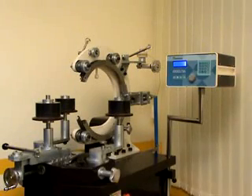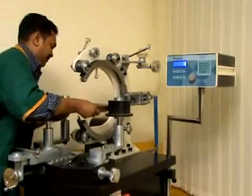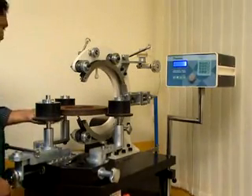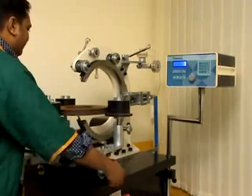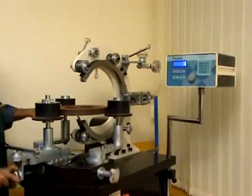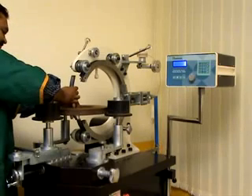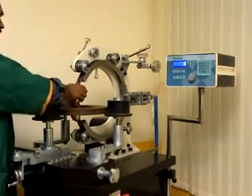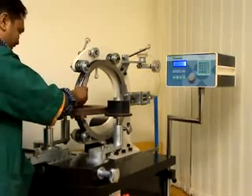To operate the winding machine, first we need to place the core. For placing the core to the roller table, rotate the magazine and ring gear with the wheel provided so that the door of the magazine and the open segment of the ring gear are in line with the opening of the winding head. Then place the core, open the magazine door, and open the sliding arm of the roller table by opening the side lock using this lever. Place the core, close the magazine door, close the sliding arm, and ensure the lock falls in the right position and the core is properly placed.